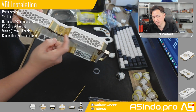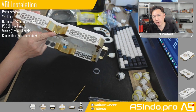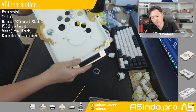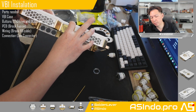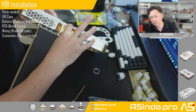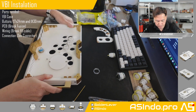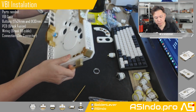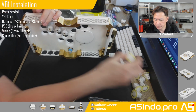Also, we cannot make the case thinner, because we want to support full size Neutrik holes. The Neutrik hole is 31 millimeters, so the thickness of these pillars is 31 millimeters. Okay, let's continue assembling the buttons.